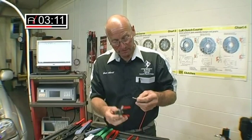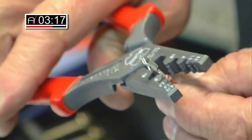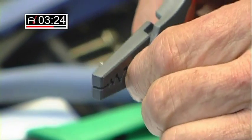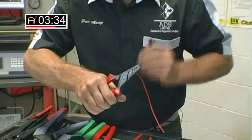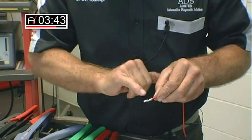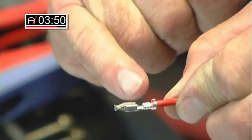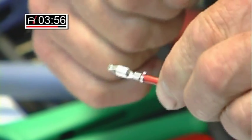Then we come to the next set of tools, which once again are purpose-built so they actually fit into the section of the connector that should be terminated. You've got your strain relief connector here and the cable is fully inserted. I'm going to squeeze this now with both hands quite firmly because I want to achieve a very, very clean, secure crimp. Now that is a perfect crimp — you can see the effect of bending the terminal onto the conductor gives us a very precise solder-free connection.